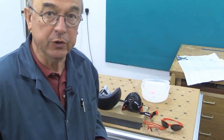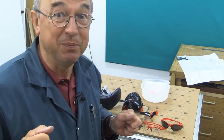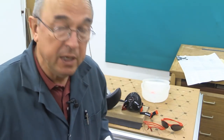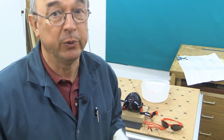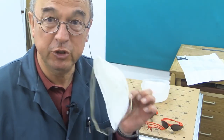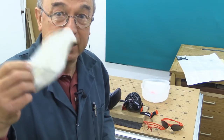I'm pretty sure everyone's aware that I'm really keen on workshop safety — that's eyes, ears, lungs, and also your fingers and things that might get in the way of something sharp. A long time ago, I made a video about dust in the workshop and the hazards it can create. In the workshop, when I'm doing something dusty, I wear a powered respirator. If I'm out and about, or in a hurry doing a very quick job, I might use one of these disposable masks. But the problem with these is you use them once, and when you take them off and put them down, they get contaminated — they pick up dirt from the bench or floor. So these are really a one-time-use bit of equipment.